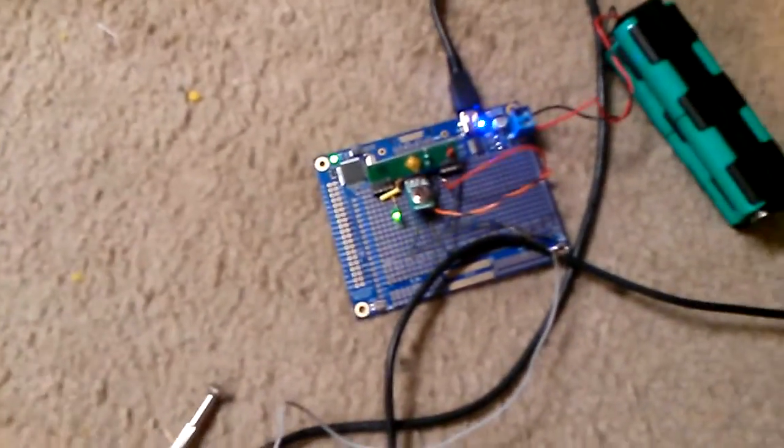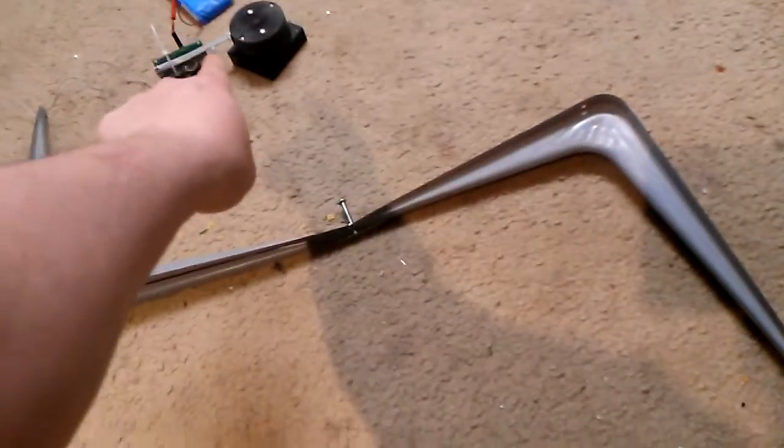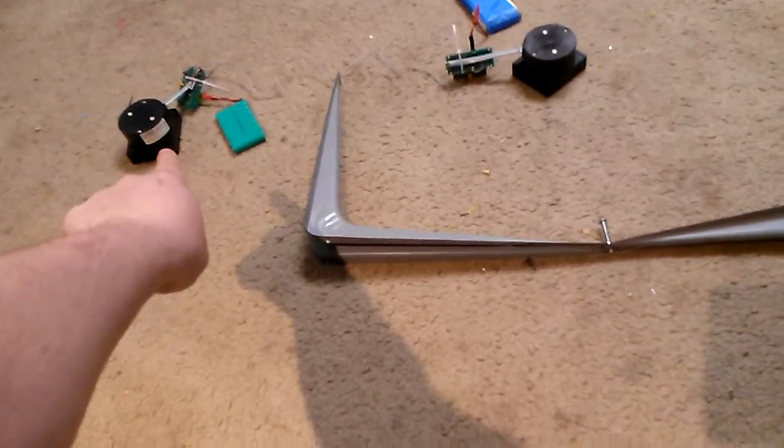Now, I haven't written the receiver on the firmware yet, so the way it's gonna work is that if I push the A key, it will try to talk to that sensor, and if I push the B key, it will try to talk to this sensor. Now this is the output. It looks a mess. This is all the noise we're getting from here. This is actually sending a bunch of noise in. That's intentional. But we can get some signal anyway.